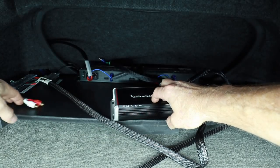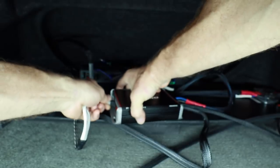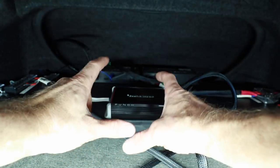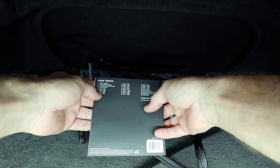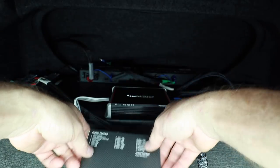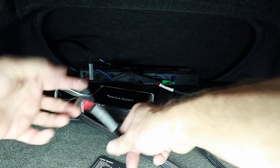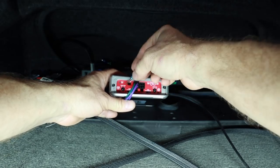The only thing left is to connect the RCA output from our front channels to this amplifier. Now we want to use the Clean circuit — the distortion detector built into it. For that we need the setup CD. We're going to start with track seven, which is a 1000Hz tone at 0dB. Before testing, unplug all speakers — you definitely don't want any speakers plugged in during this process. The subwoofer isn't plugged in yet, so we only need to unplug the front speakers.